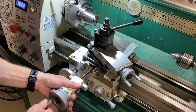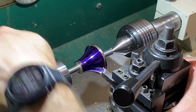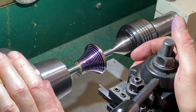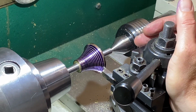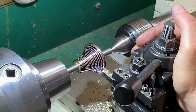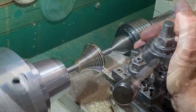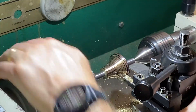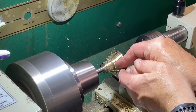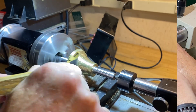This is a trick for cutting the threads — you remove the cross slide and put in the DRO. It's set up at 14 threads per inch, and you can see me manually moving the lathe and pushing on that. When you remove that resistance you can literally slide it in there with the pressure of my hand, but it will follow the 14 threads per inch, and you just keep cutting. That cutter is a custom-made cutter I made to get the right slot in there for the line. You can see now with a file, very carefully clean it up, because you will get some chatter the way I do this.